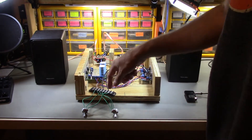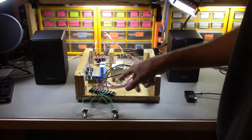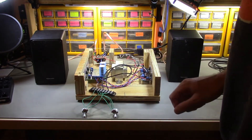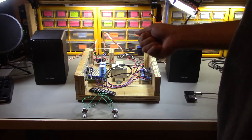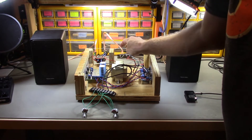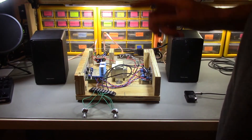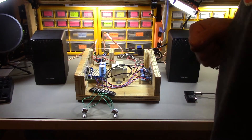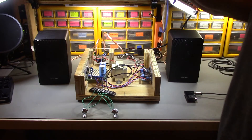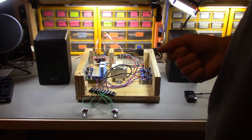The audio input comes in, and right now all the wiring is done temporarily on a terminal strip. Here are the audio potentiometers for left and right volume controls. The input signals go to the LM1875 modules, which are powered from our power supply board with positive and negative voltage rails set at plus 14 and minus 14 volts. The speaker outputs go to a speaker jack connector, and the actual speakers are Realistic Minimus 7s — well-regarded RadioShack speakers from the late 70s or early 80s. They're die-cast metal, super heavy, and sound great.